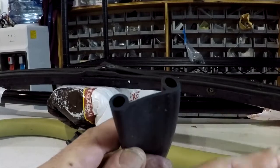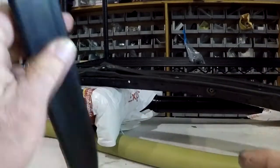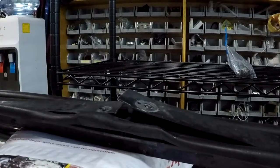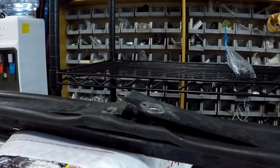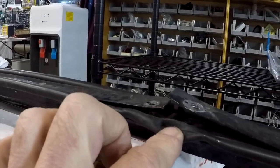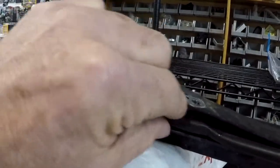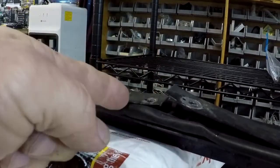Now you notice it's not symmetric — there is a bottom and there is a top, and the metal piece right in here, let me slide over here to my demo model, it goes in just like that, so the metal piece goes up. We have seen these installed upside down, which puts a lot of stress on the rubber. Notice in this particular bow here, removed from a Cheetah, that when they installed it, they didn't trim the double bead seal like we did yesterday, so it causes a problem right here and was causing canopy problems. So anyway, this has to be notched out.